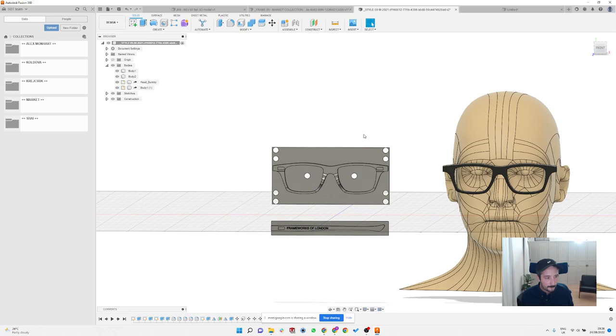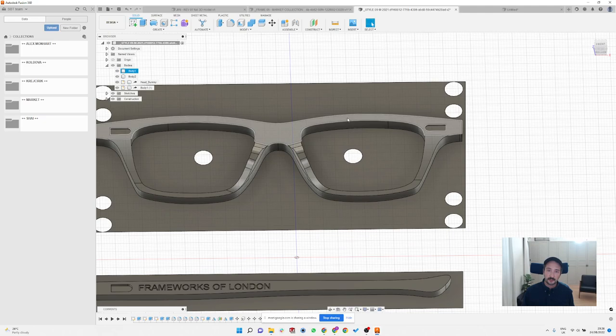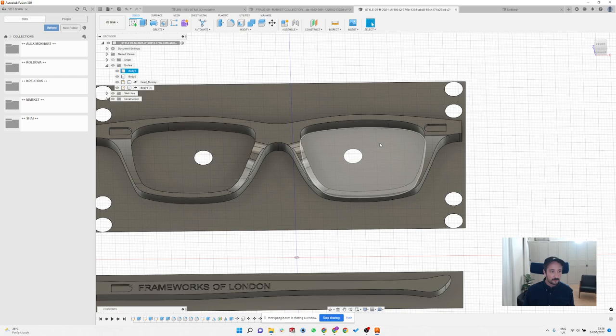Question: do you ever bother modeling in the groove, or try to cut it on the machine? Answer: I tried it and it works really well — you basically create a V-groove anywhere on the frame and follow the lens. It works quite well, but it was a little bit of a problem finding the right tool because you need a quite small diameter tool. And it was also tedious to change the tool just for that, and I was scared of making a mistake in programming the G-code for it.